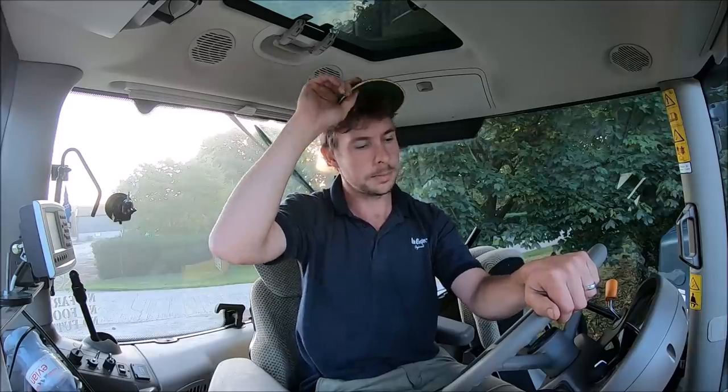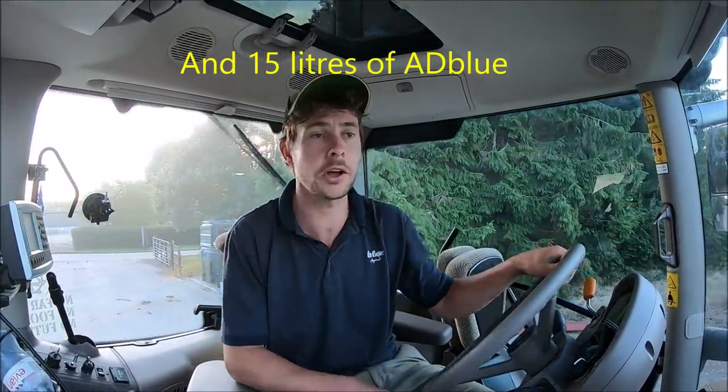Refuelled, 300 litres, so that's 5 litres per hectare, 2 litres per acre and 25 litres per hour, so I don't think that's too bad. Right, I'm going home now.